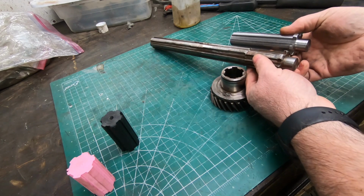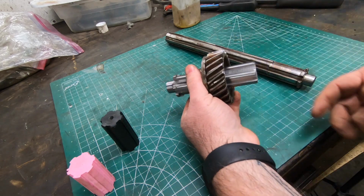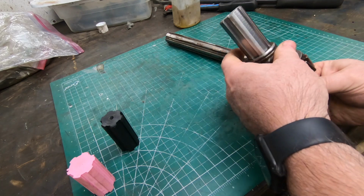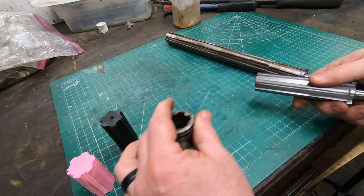And most recently, I machined this stubby version of the shaft, again, using the same techniques I learned from machining that piece of Delrin, and also took the opportunity to machine the boss at the end of the shaft where the bearing would sit.